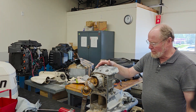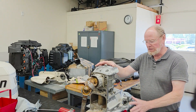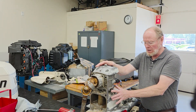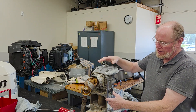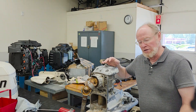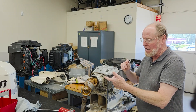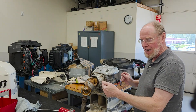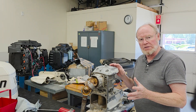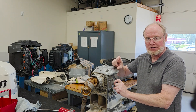Hey, it's Ted here. I've got my first ever DPS D1 - this is the second generation of DPS drives. It has a clutch pack in it. The bellows failed, and as you can see, the U-joints have gotten corroded. So we're going to change the whole inner drive shaft. I'm going to take it out and then give you a quick peek inside the clutches, so you can see what it looks like. Instead of having a cone clutch, there are now clutch packs in here.